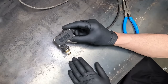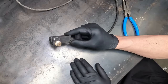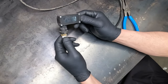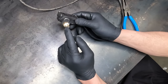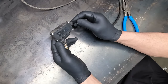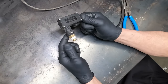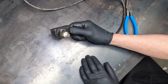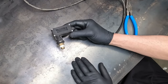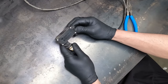Hey guys. I'm working on this PR16 hot water pressure washer switch here today. On my particular one, this is mounted to the top center valve on the pressure washer pump. What it does is it senses when there's pressure building up and will actually turn on the heater for the hot water, the boiler, or the burner. I don't know for sure if it's malfunctioning, but we'll get into it regardless. There could have just been some debris in this hole here, or maybe one of the valves in that area wasn't opening and closing properly, so this wasn't getting the pressure it needed to close the circuit and turn the burner on.